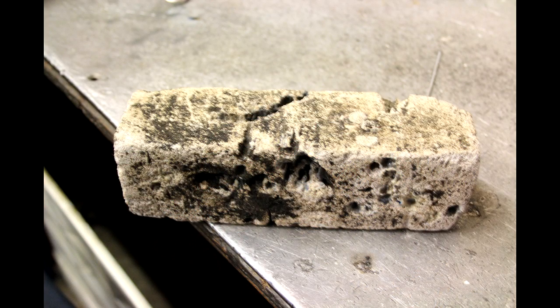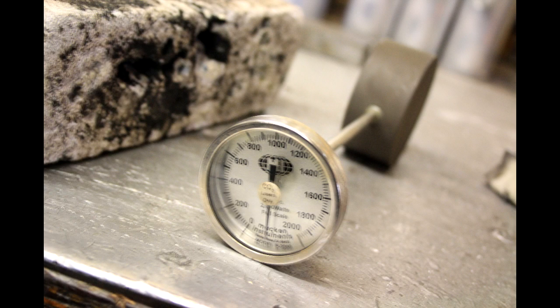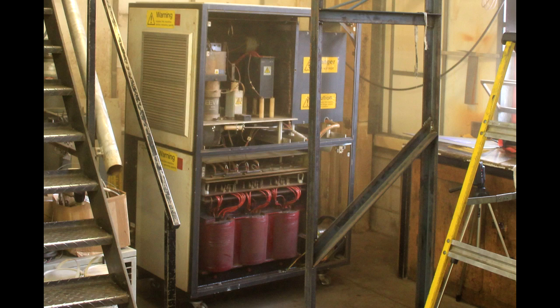There's also a cinder block which is a simple way of dumping the power during adjustments. There's also a power meter comprising a block of metal with a thermometer attached, used for short pulse tests — the temperature would rise and then you'd have to let the block cool down again to take another measurement. And this is one of the lenses — a fairly short focal length lens because this company only used it for cutting fairly thin sheet metal.